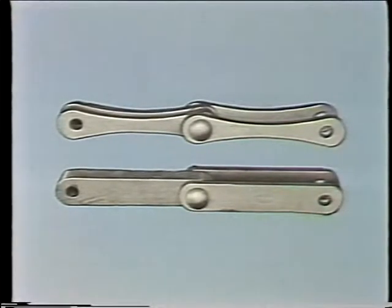Next, we have steel block chain. There are several styles of steel block chain. This type is primarily used in steel mills for handling very heavy loads at relatively slow speeds. It is available with a number of different attachments to carry, for example, a billet or a roll of coil steel. The attachments can be inserted in any one of the links.